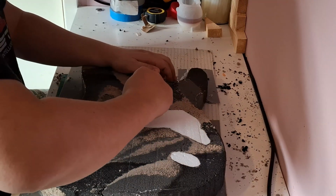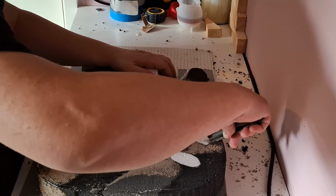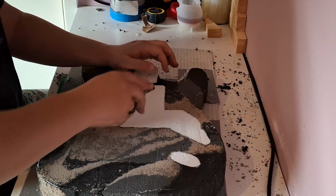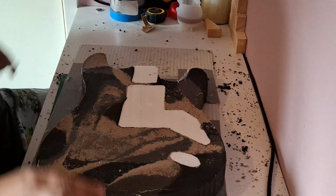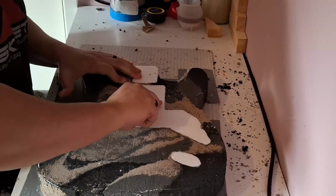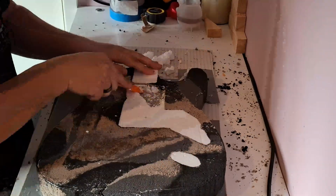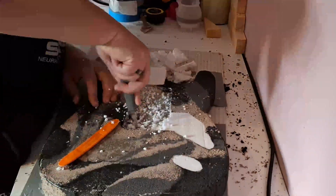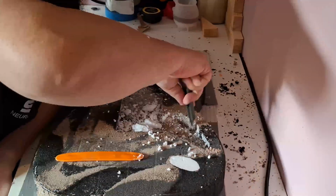And then it's just removing the polystyrene core for the control cavities. It stuck in, but the resin didn't absorb, which was one of my concerns. So I just scored some lines, got my favorite picking tool out, and just dug out all the polystyrene. It did take about 20 minutes. Nothing was majorly an issue. The only problem was it made an absolute mess of tiny bits of polystyrene everywhere.